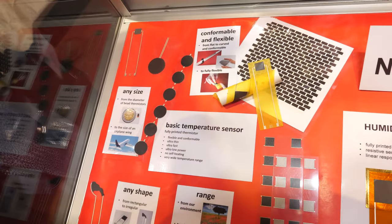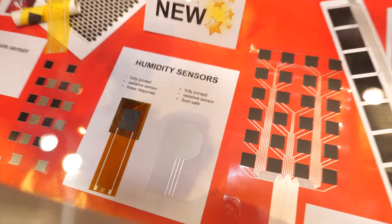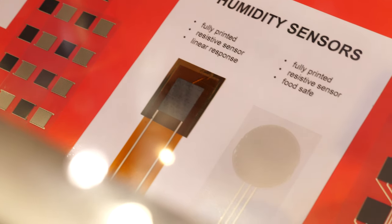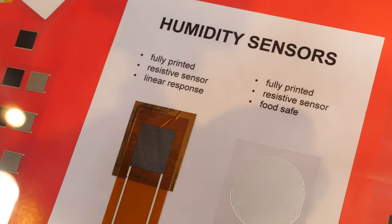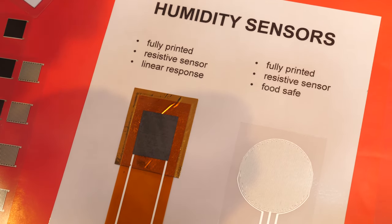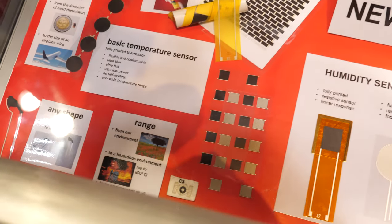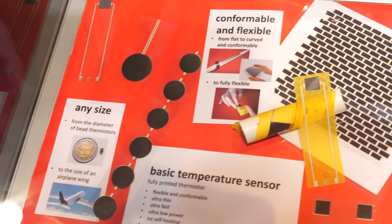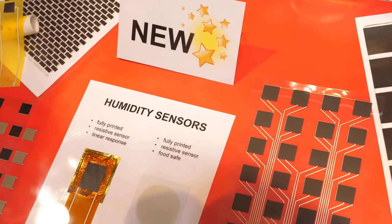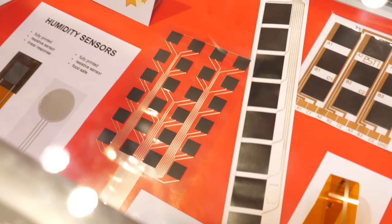Let's take a look at some of your latest devices. What is actually new are the two humidity sensors. Both are resistive. The one on the right is actually more of a traditional type of humidity sensor — it's got a very high change in conductivity as you go through around about 50% humidity. The other one on the left is based on our silicon technology, and it works similar to a wet bulb thermometer, so you actually have two temperature measurements when you calibrate against the change in humidity.